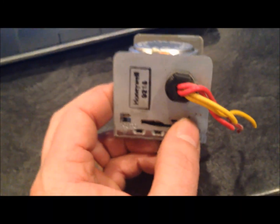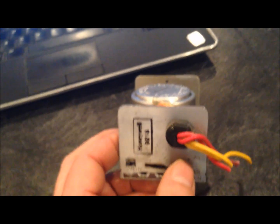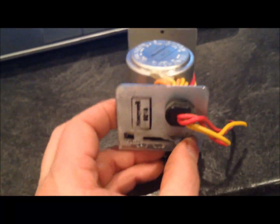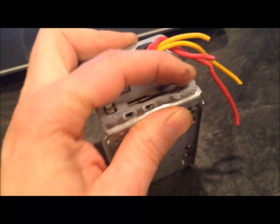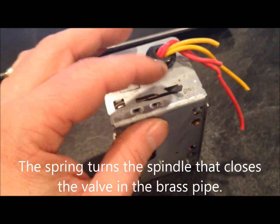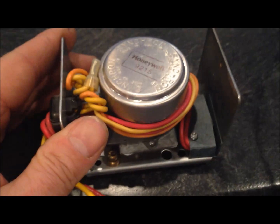The valve goes open or closed based on the thermostat. If the thermostat setting is higher than the current room temperature, the thermostat signals via these wires to the zone valve to open the hot water valve, and it does so. If you want to manually force the valve open, you can use this lever. This old one is busted — it moves a little but doesn't spring back. Usually it sits on one side and you push it over, and a spring slowly drags the lever back. You can also push it into a lock position to hold the valve open. I'm just going to dispose of this one — it's broken.